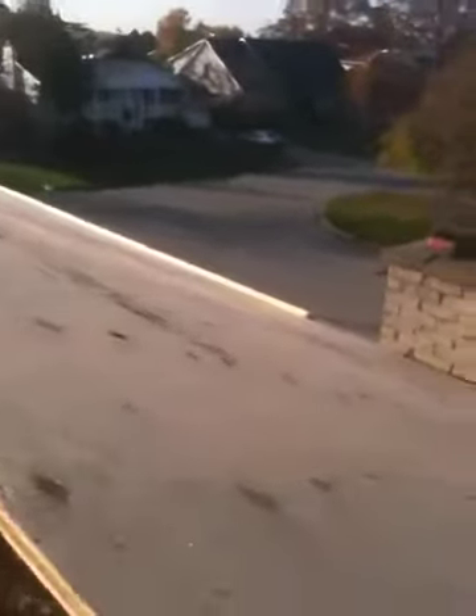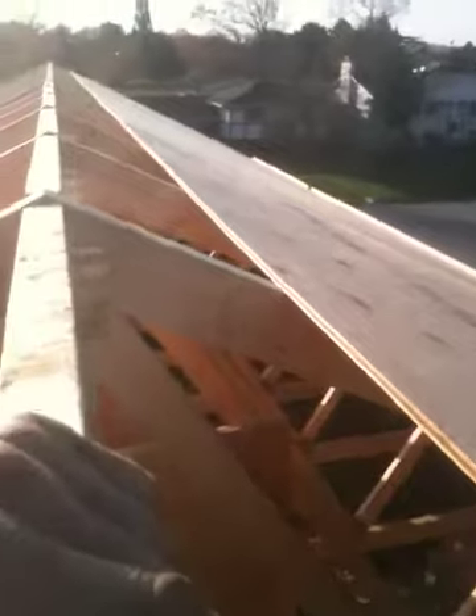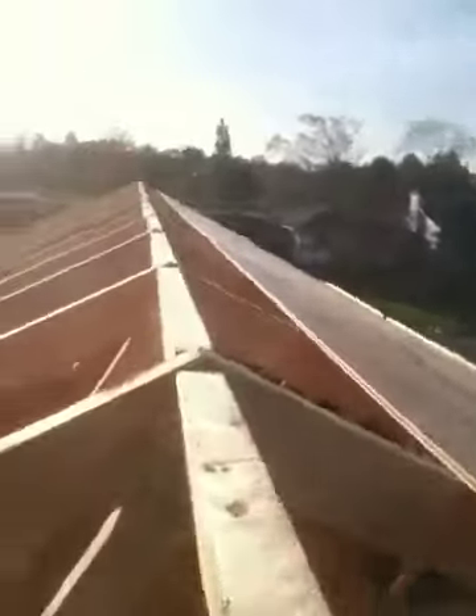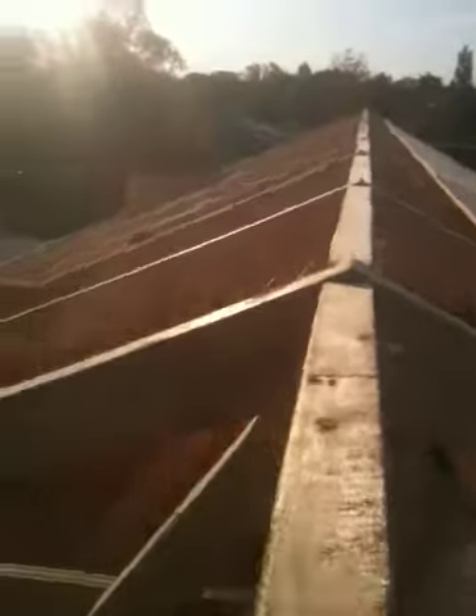As you can see, we've got a lot of plywood on, and so we're going to be putting on the ridge here. We're going to have it two inches away from the side here. We're going to have a ridge vent almost the whole length front to back, and so there's going to be a lot of venting. It's going to work out really well.